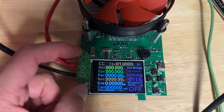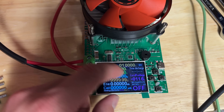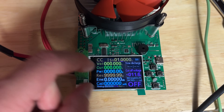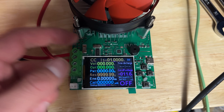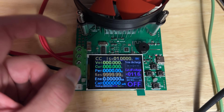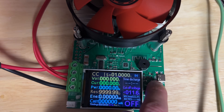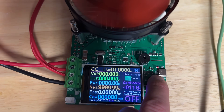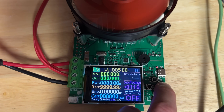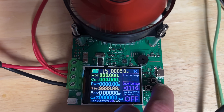So at 150 watts with a 12 or 13-volt battery, 10 amps is roughly 120 watts, which gives us a nice safety margin. It also has a power cut-off, so if you go over 150 watts it'll warn you and shut down. It'll do constant current mode, and I think you can select constant current, constant voltage, resistance, and power.